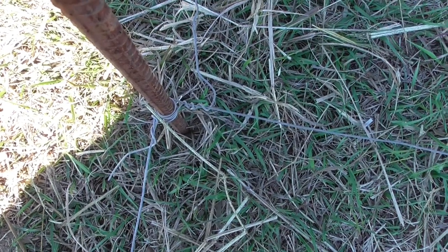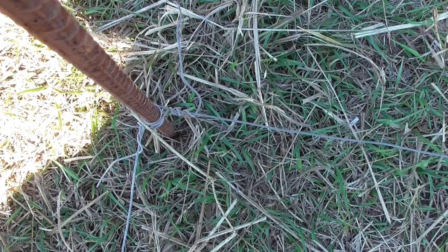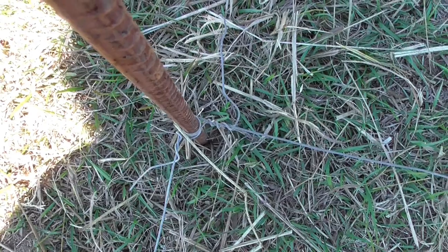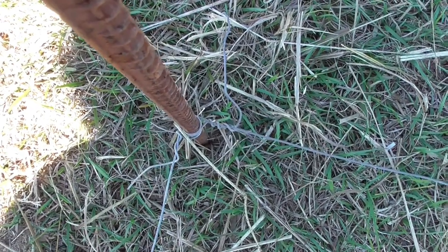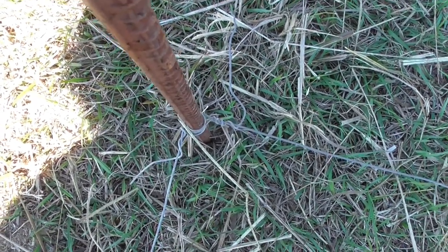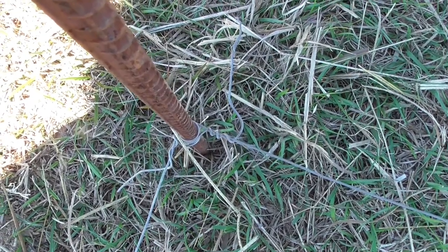This is what the corner looks like now. When you measure, you've got to be very careful to measure from the outside of where that wire is. The wire is tied on the outside of that peg and you measure from the outside of that peg to get your accurate measurements. If you don't, your measurements are all over the place and you're not going to get an accurate job. I also measure off the same side of the tape all the time, making sure my mate and I aren't each measuring from opposite sides of the tape. Although it makes only a little tiny bit of difference, you need to be accurate.